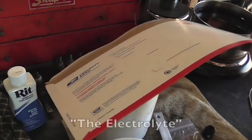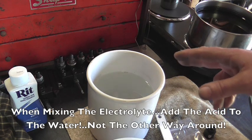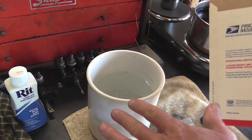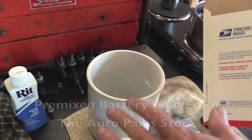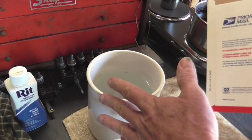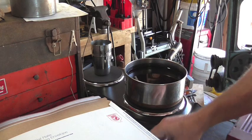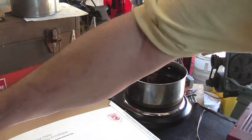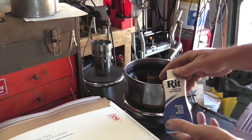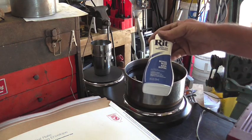The first thing I'm going to cover is the solution to actually anodize the part. I mixed up a rather large batch of this a while back and did a test part yesterday just to make sure the chemicals were still good. I used four quarts of distilled water to three quarts of battery acid. Everybody has their own variation on that, but that's what I use and it works. The next thing I have over here is the black dye, which the part will be dipped into. This was made from mixing one bottle of the Rit brand dye — it's available at grocery stores, it's very cheap — with one gallon of distilled water.